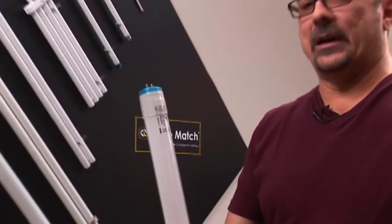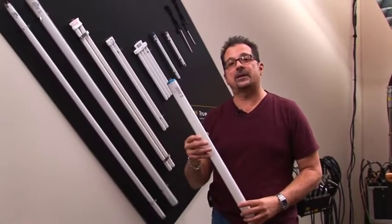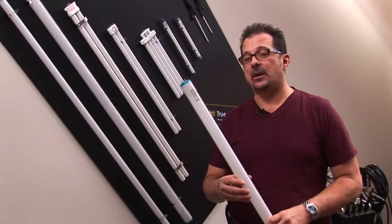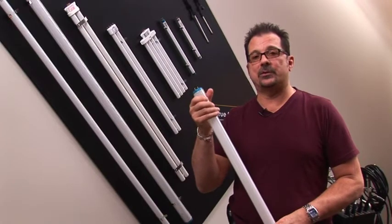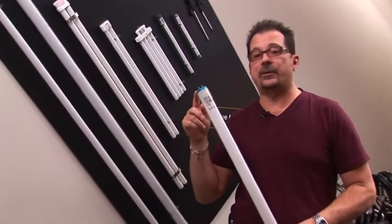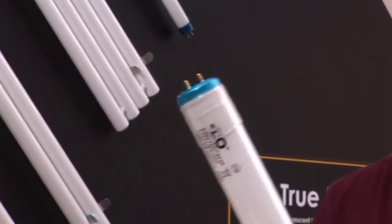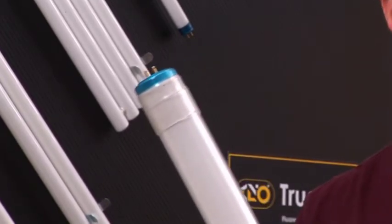3200 Kelvin has a gold ring and daylight 5500 is blue. This is the basic T12 lamp used through our single, double, and four-bank from 15 inch up to the eight-footers. One thing we've incorporated is the safety coating — a plastic shield so that if you drop it and it shatters, the lamp shards stay within this safety coating. The boot is very tight because previous designs could allow the end caps to fly off and explode.